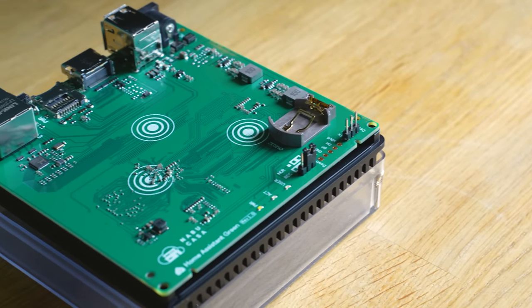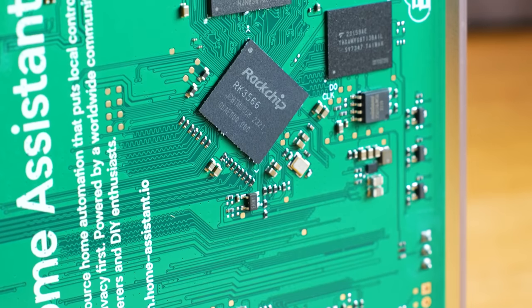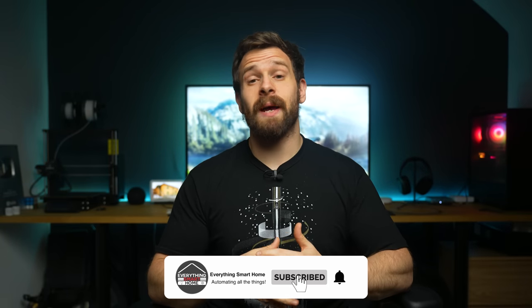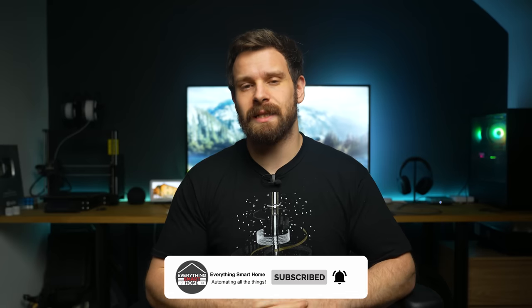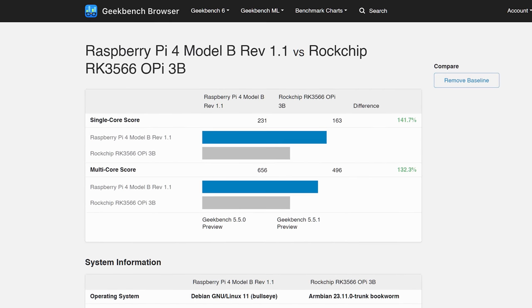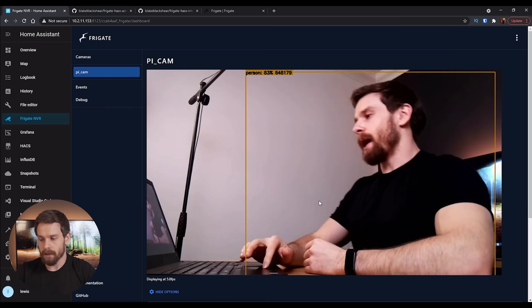The entire base of the Green is a black anodized heatsink to keep the device running cool. Inside, the heart of the Green is a Rockchip RK3566 quad-core CPU running at 1.8 GHz, along with 4GB of RAM and 32GB of eMMC storage. The CPU came out in 2020 and isn't quite as powerful as a Pi 4 in benchmarks, but as a Home Assistant server most people won't notice any speed difference for automations, scripts, and day-to-day tasks — unless you venture into CCTV footage, which would need something more powerful anyway.